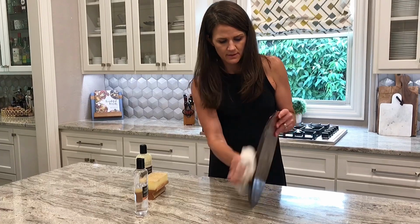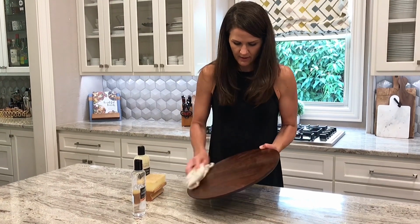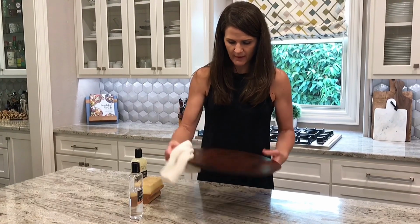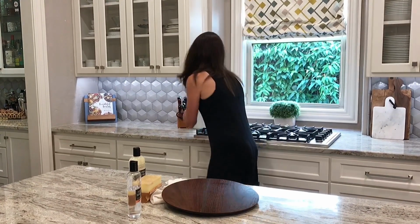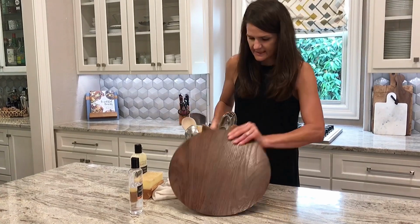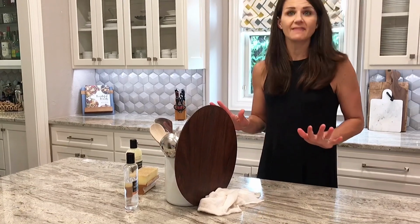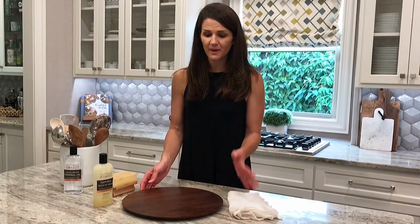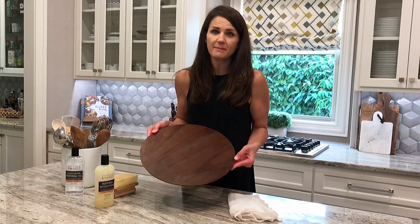So then you'll dry that. So it's already looking good and new and bright. It just really brightens up that wood. Okay, I'm gonna prop it up as well. Use this, but use whatever you can to get the board nice and propped up. So I'll leave that there until it's completely dry, at least 3 hours. Okay, now that the mineral oil has really dried into the wood, you can see that it looks good as new. And you may just stop there.